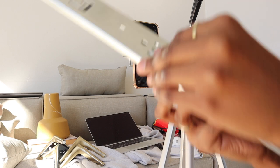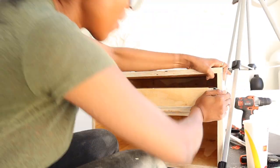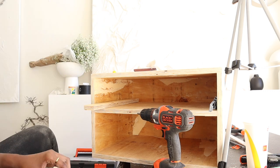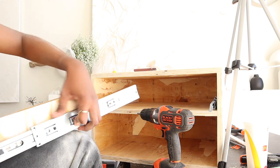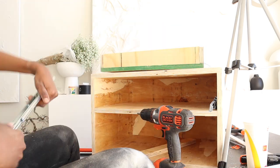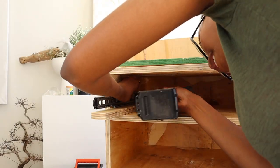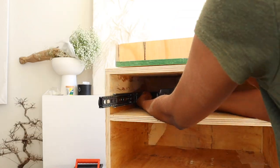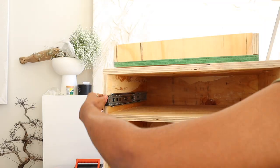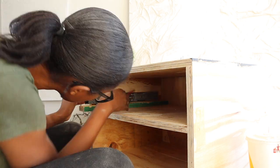The rest of the call was just Ndandi showing me exactly how to insert the runners for the drawers. I then went in after sanding down the sides of the drawers and tried it — this process was purely trial and error. After attaching it I realized it didn't close properly because it wasn't aligned straight. Using a scrap piece of wood really helped because it gave me the best support to make sure the runner was lying straight. I then did the same thing on the other side for both stands.